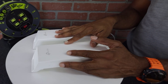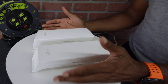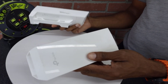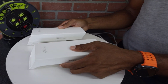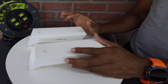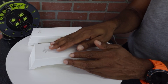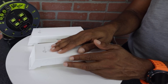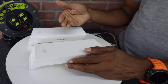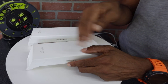If all the lights are lit but you still can't connect, it could be that you haven't changed your sign in a few weeks and there's been no activity between the two antennas, so the connection timed out. In that case, perform a power cycle. Power the antenna in the office off, and for the one on the sign, turn the sign off for about 10 seconds and then power it back on. The sign will reboot, which will also reboot the controller inside the sign and the client or access point mounted outside.